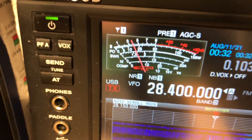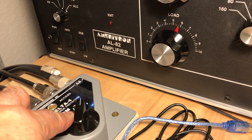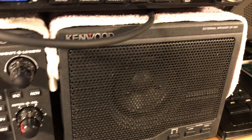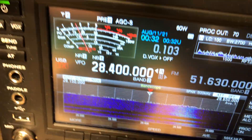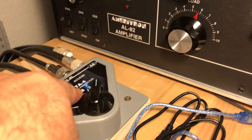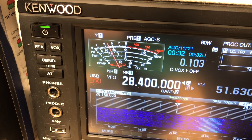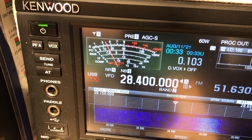See, it's not even moving the S meter, but look at the noise — that's with the loop on. Now I'm going to flip the switch, and there's the ground loop. The signal doesn't change, but the noise gets attenuated. That's amazing!